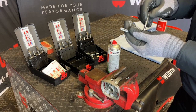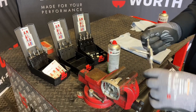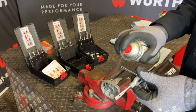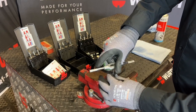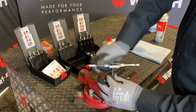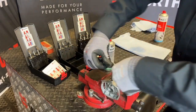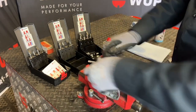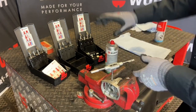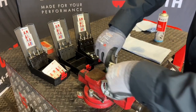Now for the thread cutting on the inside. Always remember when utilizing any form of cutting tool where you're cutting thread, use cutting coolant. Add that to your tap, making sure that you are 100% at 90 degrees to the surface. You start the process, and always remember because you're cutting away material, you move forward and backwards. If necessary, you can spray a little bit more of the cutting coolant on your tap.